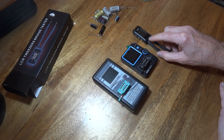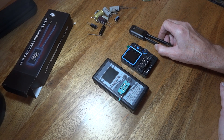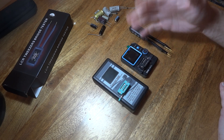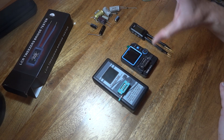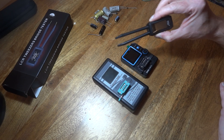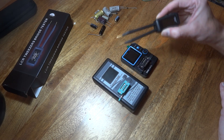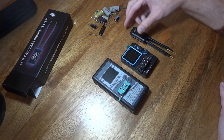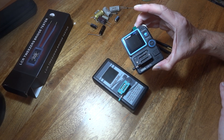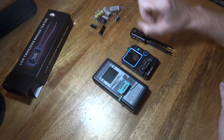I'm also going to leave a link to someone who does a more in-depth review of this particular one - the model number I'll put up on the screen. It goes through how to calibrate it, diodes, and compares it to bench measurement meters to show how close it is. I really just wanted to draw your attention to this one if you're thinking about getting a cheap meter to measure resistance, diodes, and capacitors - mainly capacitors for me. It's only about £17 or £18.